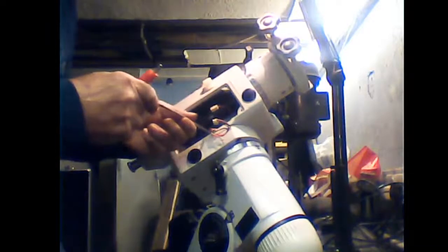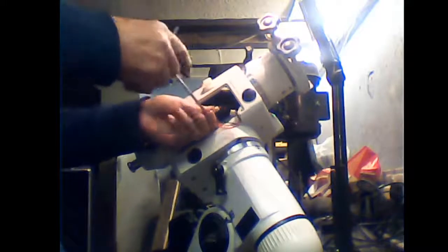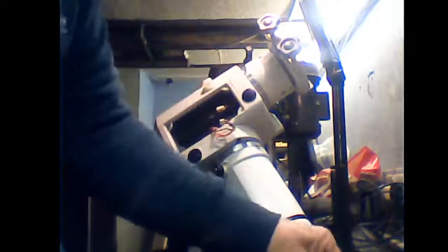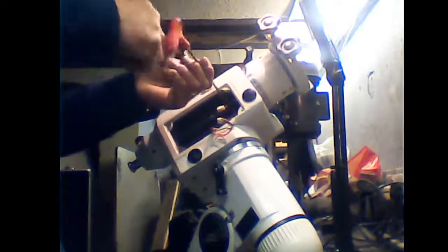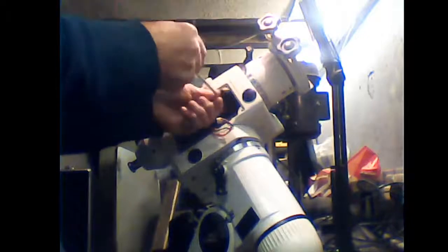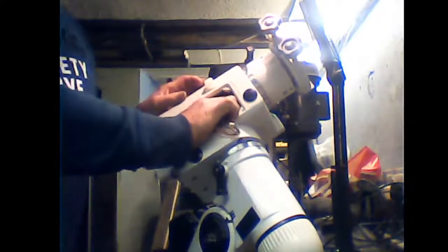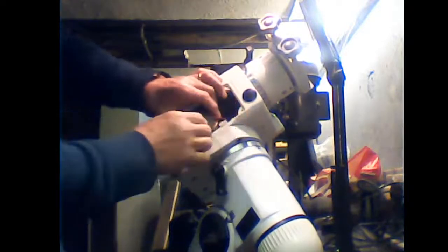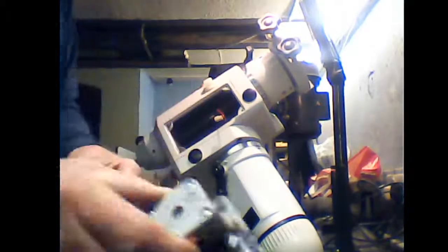Again, slacken the motor off, then take the two mounting screws out. There's one. That's two. Again, give it a little wiggle and the motor will unplug itself. And the belt, again, you can see I've slackened that off. I bring it inside here.